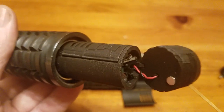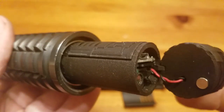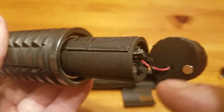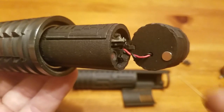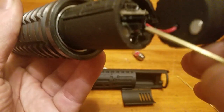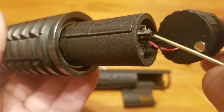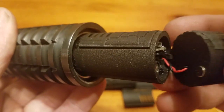When doing your speaker wires — because that's the one thing you'll have to deal with as a moving part — I have my wires shaped and placed the way I want. They go straight up into the board; they do not loop back. I soldered into the board with the hatch open, just sitting there pushed up against the plastic. I put E6000 up in there, being very careful not to get any over where the card goes in. You don't want to make a mess with E6000 — just enough. Let it set up well, and I have never had an issue.